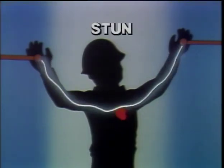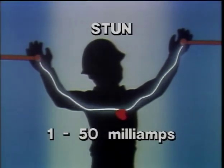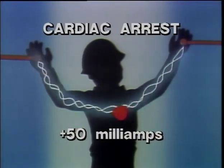How severe the damage is depends on the amount and duration of the current flow. A stun is the least severe. It is the result of between 1 and 50 milliamps, less than 1/20th of an amp. During a stun, there is a sensation of shock and some loss of muscle control. Above 50 milliamps, there may be a cardiac arrest or fibrillation if the current passes through the heart.